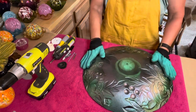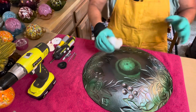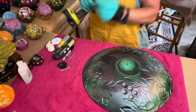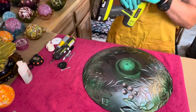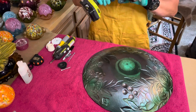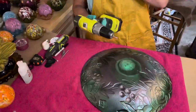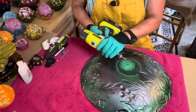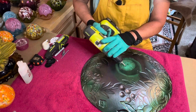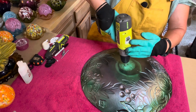That's right in the center where I can see it — I've already marked the center. I'm going to add a little bit of water and I'm putting a new drill bit on my drill. I think it's highly advantageous to do that when working with a new piece. I'm going to start the drill at a 45-degree angle, really slowly, and as soon as it cuts into the glass, I'll move it straight up to a 90-degree angle until I pierce the glass.